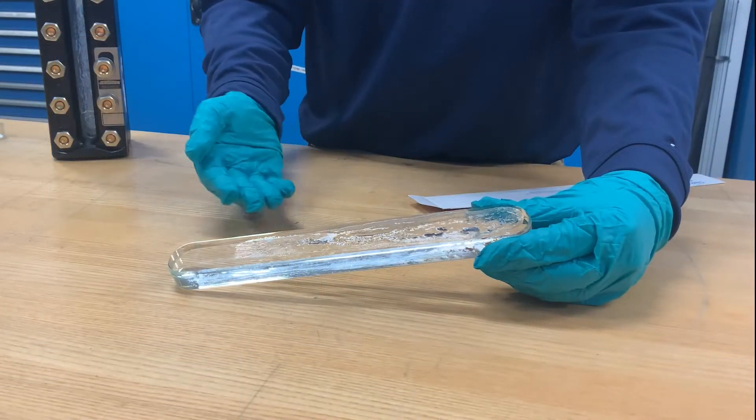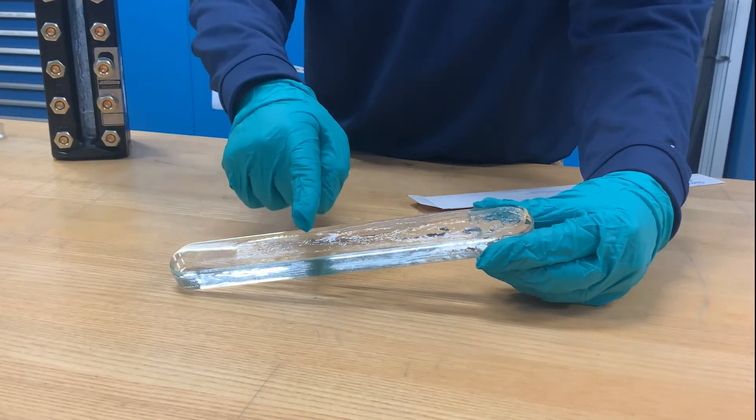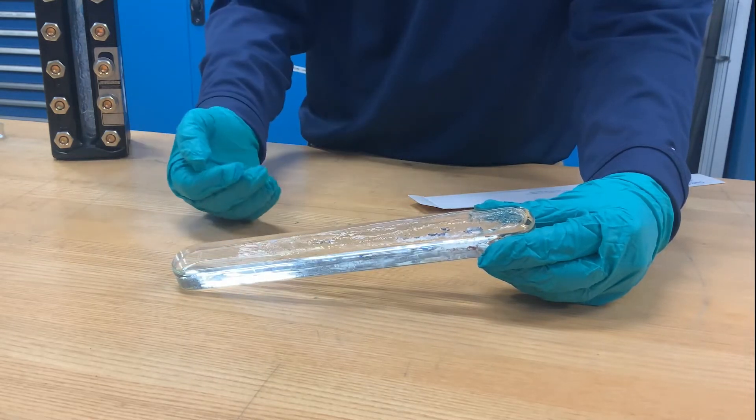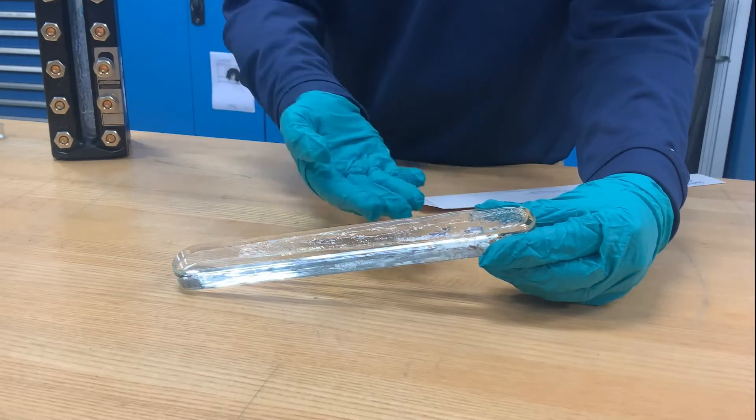Here is an example of a piece of borosilicate glass that has been corroded by steam. You can see that the water-steam line was about there and as the steam started to etch into the glass, it's been corroding it over time. This is a potentially very dangerous scenario and what we're trying to protect by using a piece of mica.